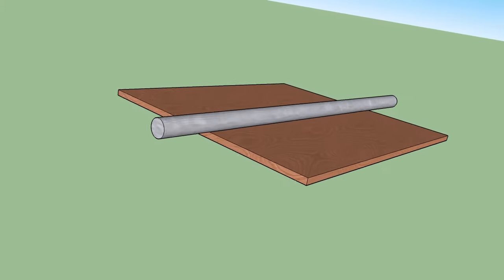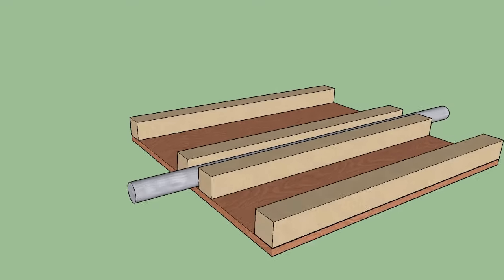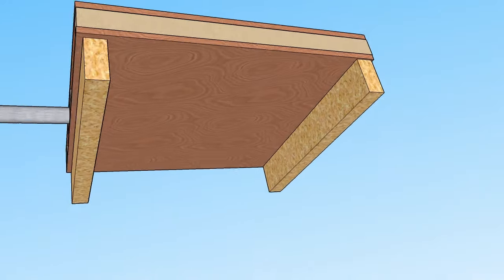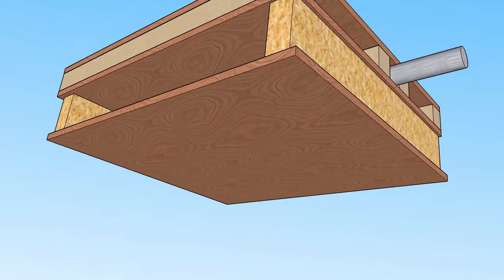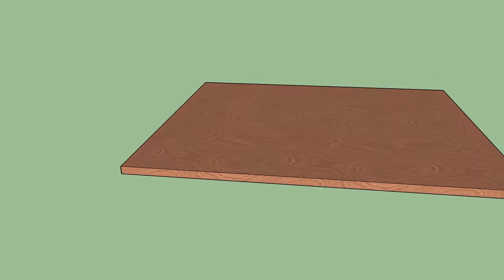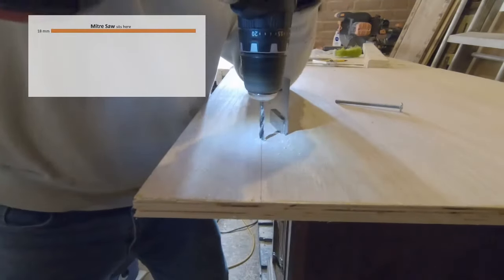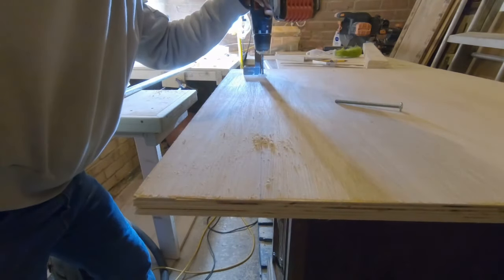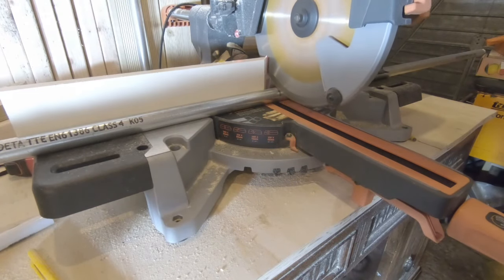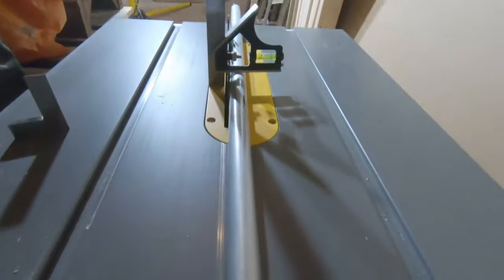The flip-top consists of five parts: an 18 mm plywood base where the miter saw sits, a 25 mm support layer, the pivot rod on which it flips, 25 mm support pieces, and another 18 mm plywood on top. Two 2x4 pieces matching the width of the miter saw make it level to the bench, and when you flip it around there's another 18 mm top. For the pivot rod I'm using EMT conduit tube, which is cheap and readily available. I cut it to around 1.2 meters — these tubes are 25 mm in width.